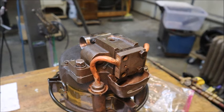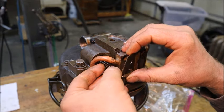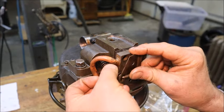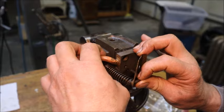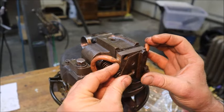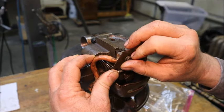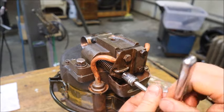The opening for the unloader rod is there. This is keyed and the piston has a key in it that fits in. It came out of there so I know it can go back in - there it goes. Now these two head bolts go in there, and I'm going to torque these to the standard torque for the 5/16th standard thread bolt, after I tighten them by hand just to get everything assembled.